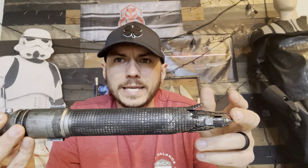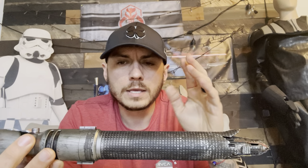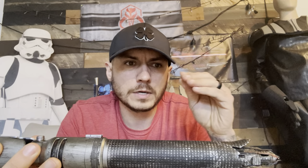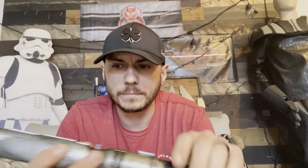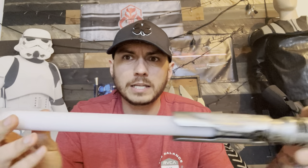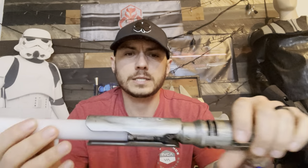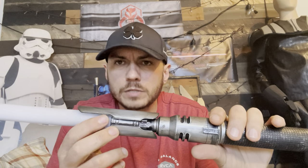For the setup, I made this pixel back here just mirror what's going on with the blade, but it is wired separately, so it's technically a separate blade. On each one of your sound fonts and your config, you're going to have two blade styles — one is your main blade and then one right underneath it. You can program this back LED to do whatever you want. So the last time we hit the activation switch, this time we're going to do motion controls. I've got a little one-inch diameter test blade to use. I'm not going to use your blade retention — which is right here — because this is a very tight fit. If you have a new blade, you're going to find yourself sanding that blade to fit in here, so just be aware of that.